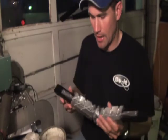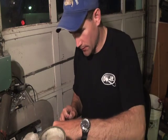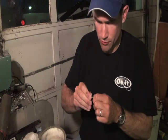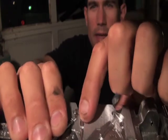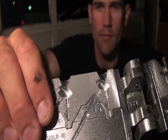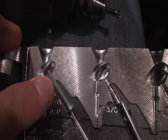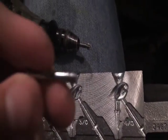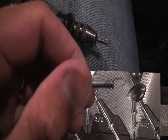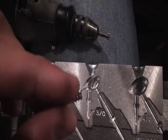I'm going to make it so that I can push this thing right here — these are screw locks — and take the insert for this and just shove it right into this medium screw lock. We're going to situate that so the little turn part of it goes into the lead which grabs it, and instead of the bristle you're just going to have that little screw sticking out. This mold is designed to close very nicely with very little tolerance with the bare pin in there, but once we add the threads of this corkscrew screw lock, it will not close. So we need to modify this section right in here just enough to allow those extra threads of the screw lock.